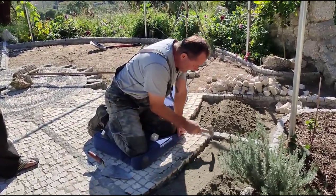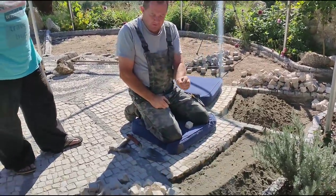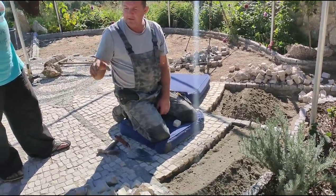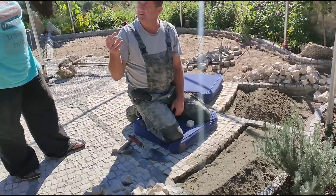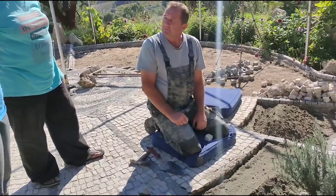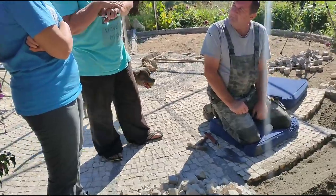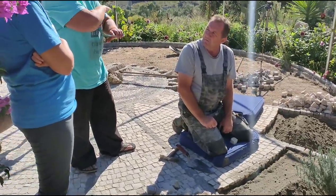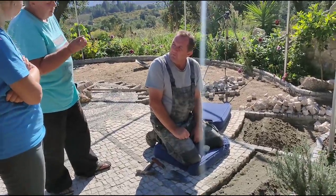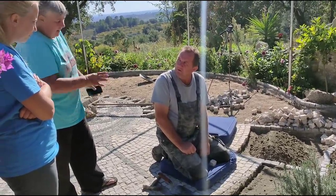But the original Portuguese calçada, they lay it on a coarse sand or a very fine gravel. The problem with that here is it gets seeds and stuff in it and grows up in the joints, and then you get ants and everything. So what they told me to do with those paving stones that I'm going to put in the kitchen is I do the gravel, the brita, then I put a sheet of plastic to stop the weeds, and then they gave me the coarse sand, because they said I don't need the cement. Do I still add a bit of cement with it?